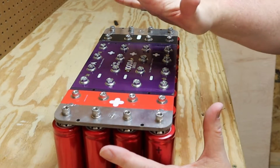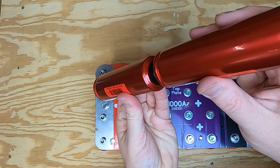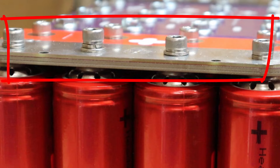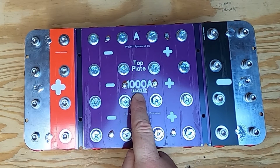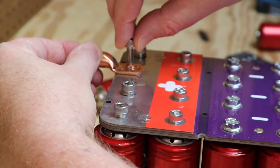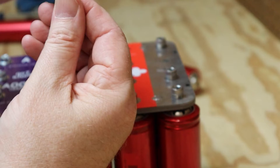Here I've got the entire thing assembled and I ran into a problem — I ran out of screws. The Superbeast came with some threaded hardware to connect things in series, but when I put these on the JAG35 bus bars I ran out and had to order more. I ended up getting Allen head screws, so they don't match. Also, the end pieces are triple thick, so you need longer screws to fit lugs on. If you're repurposing a Superbeast, go ahead and order some longer screws — the challenge is finding ones that won't bottom out into the batteries. I'll give you a link to what I use down in the video description.